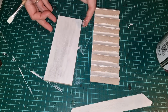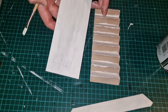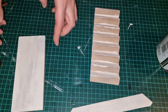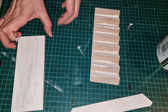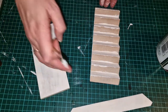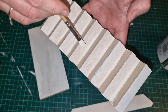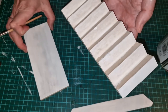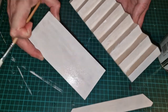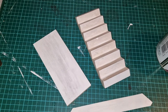I've ended up painting the underside of that bit. I've got the white out, so rather than get the big tub of silk paint - it's not really sealing as such, it's just under a cupboard, so that'll suffice. But I just wanted to show you the difference between the edge of MDF, which has gone that white colour after one coating, as opposed to all those other edges which have been done in white. Look at the difference - that's white, but this has just soaked completely in. So it's going to need a good few layers.